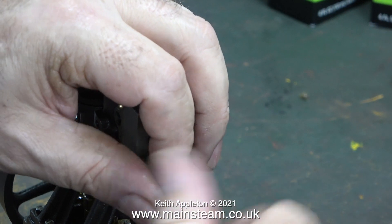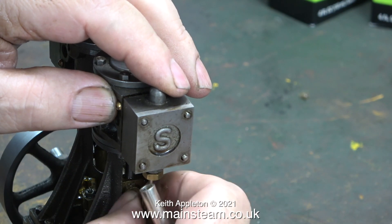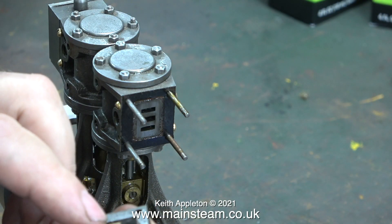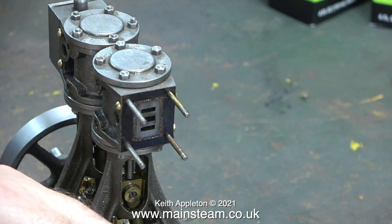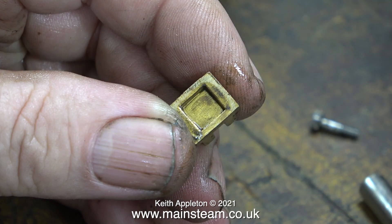Here I'm removing the securing nuts, and then I'll remove the pin that holds the eccentric rod to the valve fork. Then I can withdraw the entire steam chest and have a look at the port face — and this doesn't look right to me. The port face isn't scored, and more of the valve has been contacting it. It's time to look at this other slide valve and see how much better it is than the one previously seen. And the answer is: not much really.